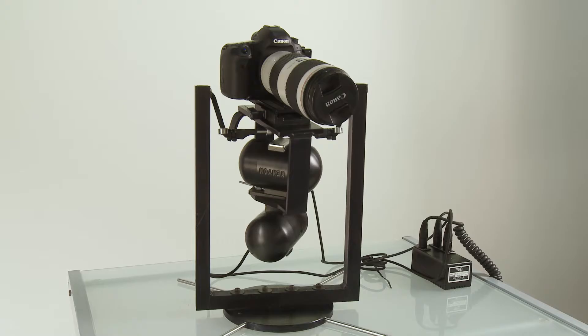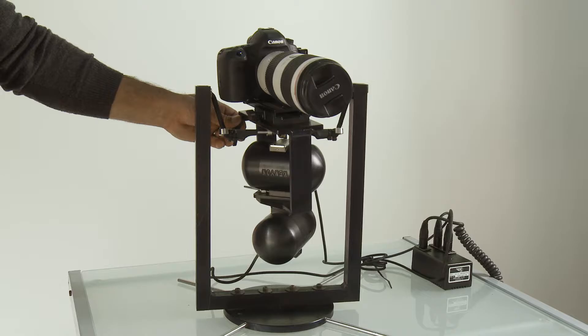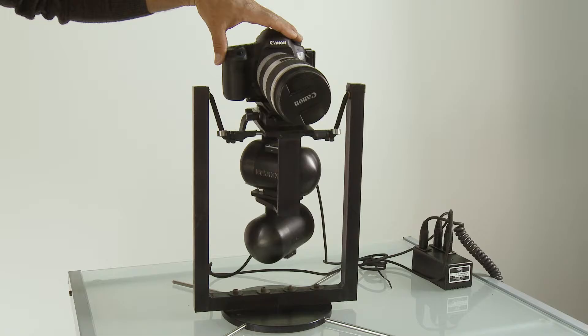It's been 10 minutes and the unit has fully spun up to speed. Each of those gyros is now doing 10,000 RPM and the platform will resist being moved. Moving it back and forth feels relatively smooth but with resistance, and bouncing up and down it wants to stay in the same plane. If I try to lift it, it feels incredibly heavy — that's just the gyros resisting moving out of plane.